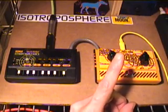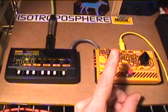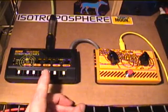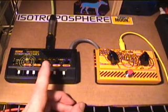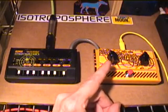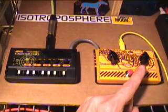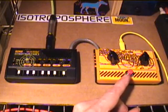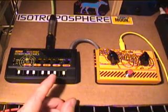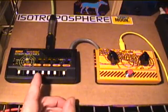I'm using the CV gate input, there's a raw VCO output. In Korg's addition of the Delay, they took the resonance control for the filter out of it, so this mod adds the resonance control back into the filter. This is a manual pitch control, and this is a push-button gate. I've effectively eliminated the need to use the ribbon, although I have not removed ribbon functionality — it still performs exactly like it did stock.